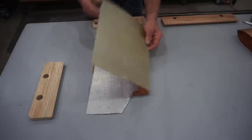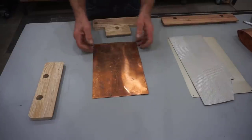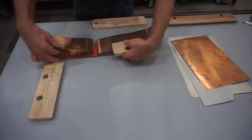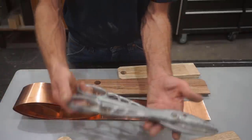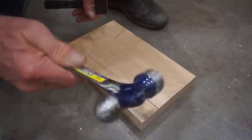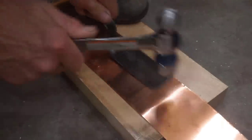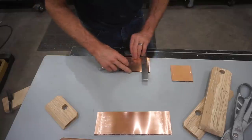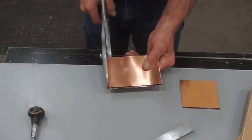Various kinds of sheet metal will work for these parking brakes. Aluminum is a good inexpensive choice and comes in different thicknesses and types. For mine I'm going to use copper because I have some on hand — it works great and looks pretty cool. I'll use a three-and-a-half-inch wide strip because when I index it on the rabbet it leaves about two inches hanging over, which is plenty for the power tool wheels to park on and engage the parking brake. I use large shears to cut pieces to approximate length, then use a spoon dolly, ball-peen hammer, and a dense flat block of maple to flatten out the wrinkles in the strip. A scratch awl is much more effective for marking accurately on sheet metal, especially copper.